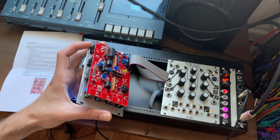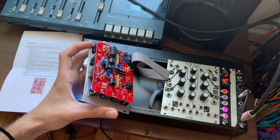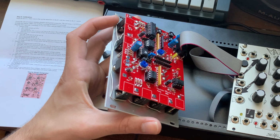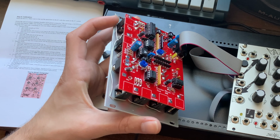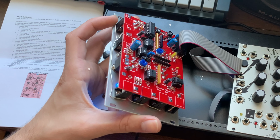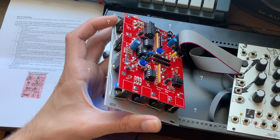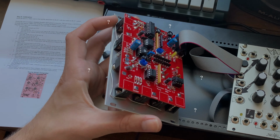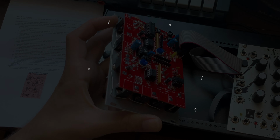Squelch is set. Next step, oscillator tweak. Turn PHI 500K trim pot all the way up. Okay. Turn position knob all the way up, turn frequency knob all the way up. Turn oscillator 10K trim pot until you hear about a 10 kilohertz tone. Oh, geez. Doesn't need to be exact, and you can change this later. This trim pot merely sets the maximum frequency of the internal oscillator produce. Interesting.